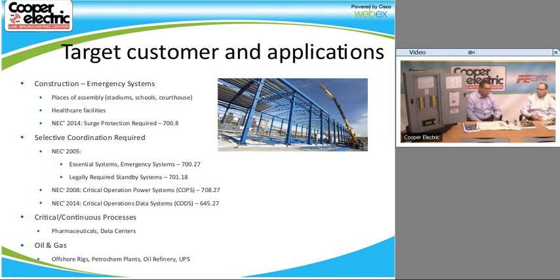I know all the dialysis places going up in the past year and a half or so with DaVita and FMC. We've got a lot of those facilities that are using the fusible panel board because it's easier to selectively coordinate. I know we also had an Amboy medical facility that was spec'd in as a fusible system. They put in a circuit breaker job, and then they had to remove all the equipment and put in a bunch of these quick spec coordination panel boards.